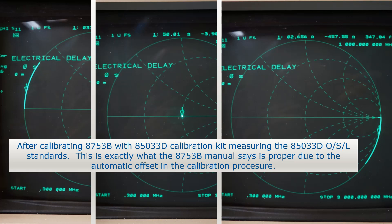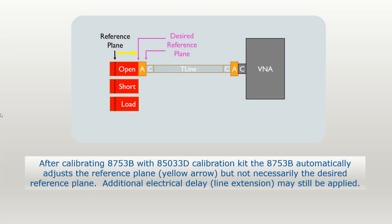The manual indicates that that's exactly correct. The reason it's correct is because the VNA, via some mechanism, and maybe an adapter if you don't have the right sex calibration loads, somewhere past the adapter is where the actual reference plane for the calibration loads is. My 8753 takes that and moves this reference plane back to this point, knowing precisely what the measurements are on those little loads in the 85033D calibration kit.